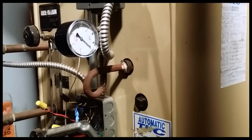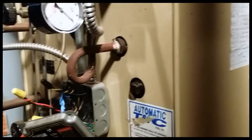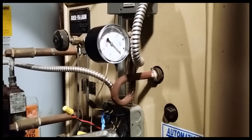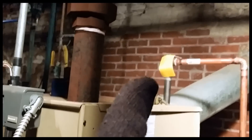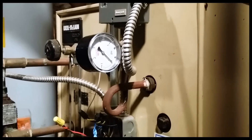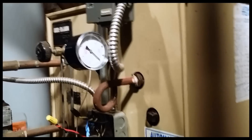The only thing that has been suggested is the pigtail — that this might actually be corroded. If this is full of junk, then the cut-in, or cut-out, whatever you want to call it, will not register the appropriate amount of pressure and therefore will not cycle the boiler appropriately. You'll get too much pressure and then that will crack, and you'll have steam everywhere. So the thing to do is actually pull this off and see if there's junk inside, see if it's clogged, and then maybe even fabricate new. Always an adventure.